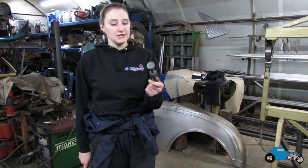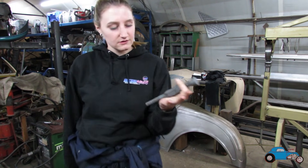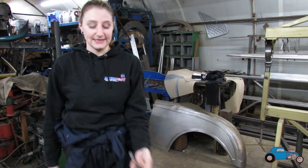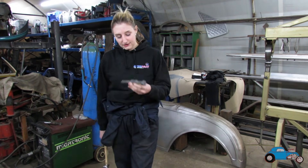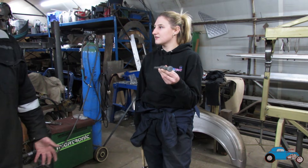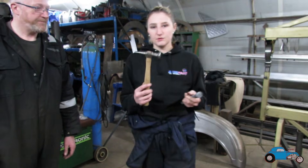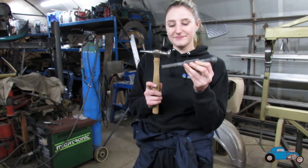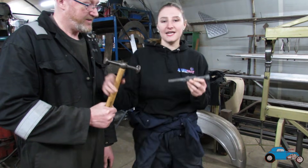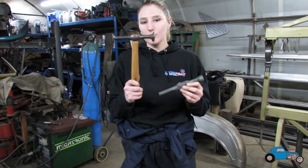We're now at the point where we've just finished forging the hammer. We have a little bit more material than we perhaps needed, but that's a good thing - it's better to have material you can remove rather than not having enough. You can't put metal back, and you can weld it but you don't really want to - you try to forge it out of one piece. It's taken a bit more time than I anticipated, but forging is all about moving metal - you've got to heat it up red hot and move it, and that isn't easy to do. So this is the one we were basing it on, and it's actually probably a bit more like that now - that's looking more like it. Forging is not easy, and to have a hammer head that resembles a hammer on the first go is a real achievement.